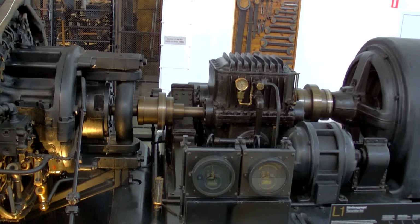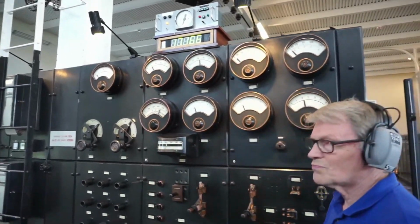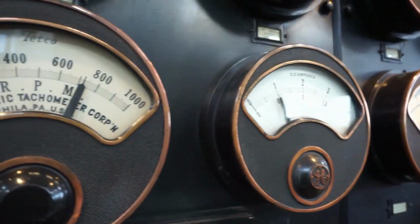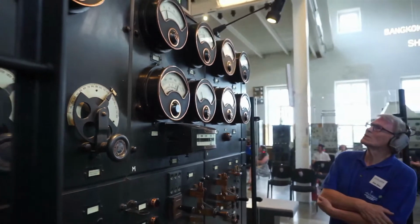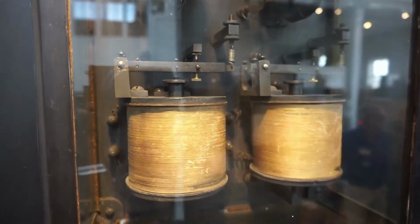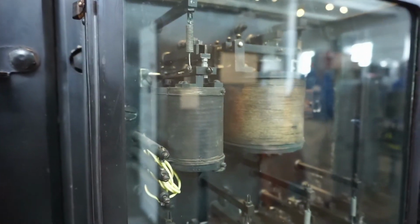Now we have to control the frequency, and it has been a little lower, so now we are using the start resistor to tune the frequency. It's a pity you can't see, perhaps you can see it on the... I think just now we have 17.18 kilohertz, and I think we should be satisfied.